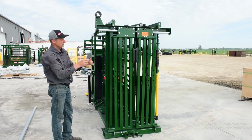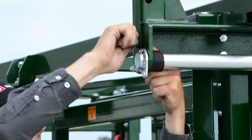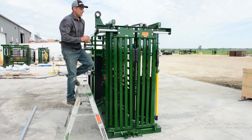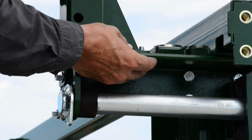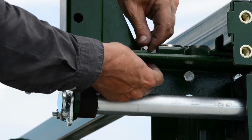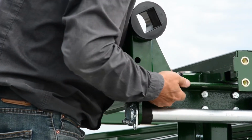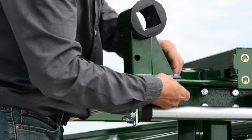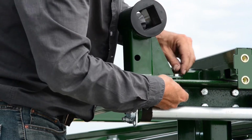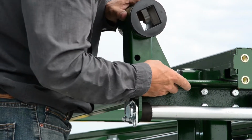Now I've got my fasteners. You've got your 1/2x1 bolt in the bottom, and your flange nut. And you've got your 3/8x1 bolts on top. And the other thing I do is I keep all my bolts and nuts loose till after the process is completed, and then I tighten everything up, or otherwise you're going to make life very hard for yourself.